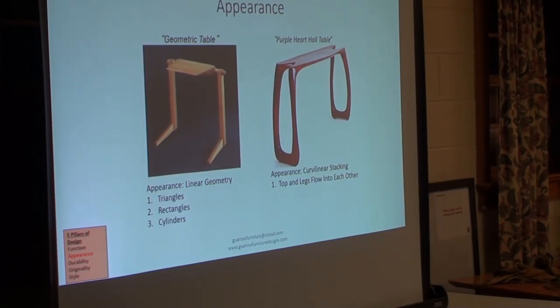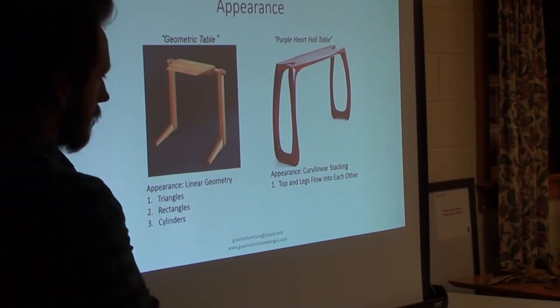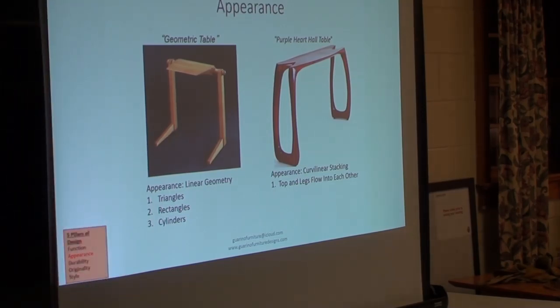To get started, first we put the ground line down, measure up for the surface of the top, find a center line, and then we go from there. I drew this just a little while ago, and this is actually a half pattern, half scale. When you do a half pattern, you can then take a template off of that and just rock the template over, and left side, right side will be identical.